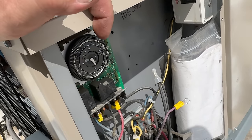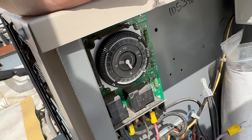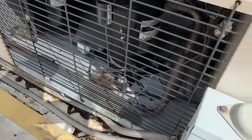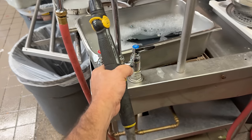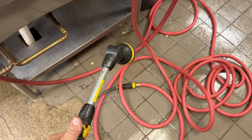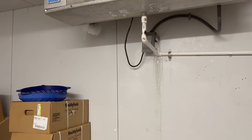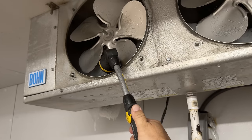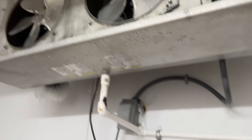This here is going to kick it out immediately — there's a solenoid on the back side that triggers the switches, and on a mechanical one it triggers and moves a slider to make it kick out. We're going to let this continue to heat up. I don't feel like messing with a pump sprayer, so we're gonna use this instead. The shrouds are taken off and I'm going to try to shoot right through here to the pieces I need. I'll definitely make sure the drain works when it's all said and done.